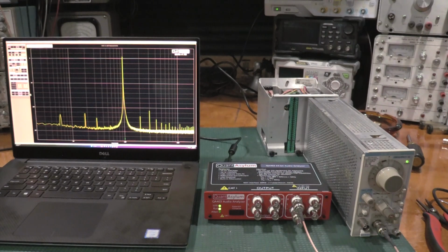And we did actually go down. Our THD plus N dropped another couple of percent, we're really splitting hairs at this point. It's 0.00051. Oh, and our THD dropped to 0.00036. So ground referencing the input did definitely have some improvement in the signal quality. Still, way below specification for this particular unit, and I am extremely happy with the way this is performing. Everything looks good, and we're ready to service some units.